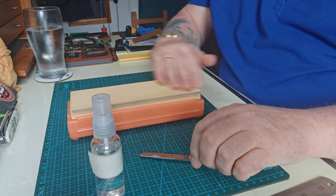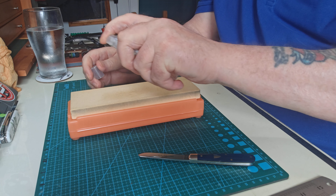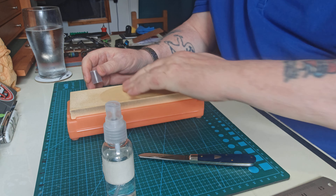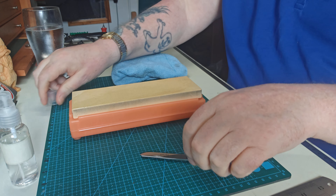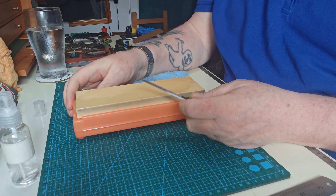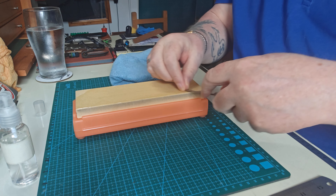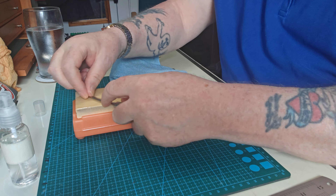The reason I picked this stone is because the end of the blade seemed like it had a stubborn little burr or maybe just wasn't sharpened properly. If it was just a bit gritty I would use my little strops. This one has three micron diamond spray and this one has one micron diamond spray. I use them starting at the three down to the one and that will get me a nice screaming edge. I keep them in separate bags so they don't get cross-contamination.